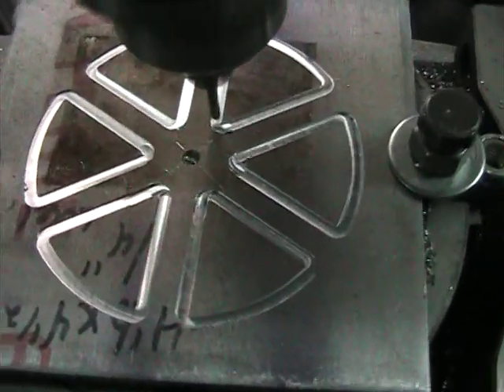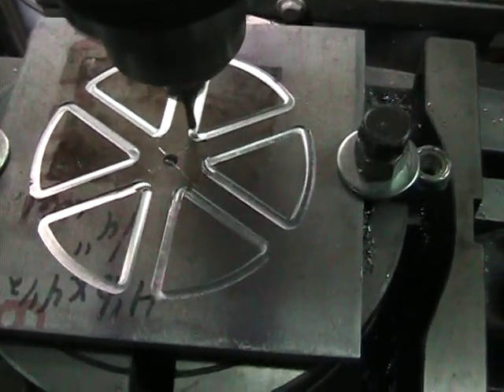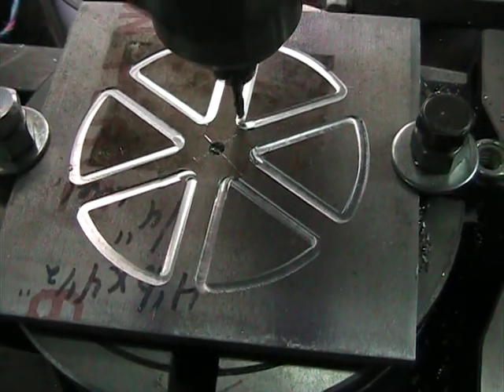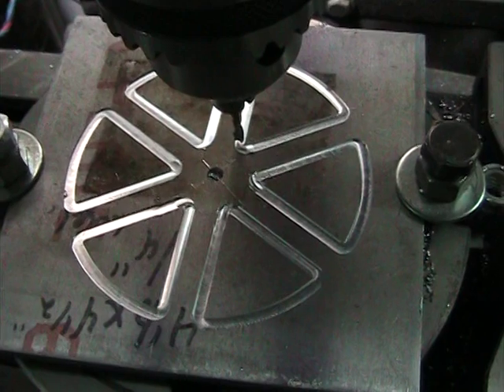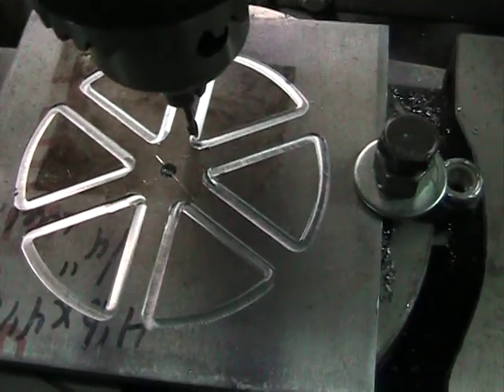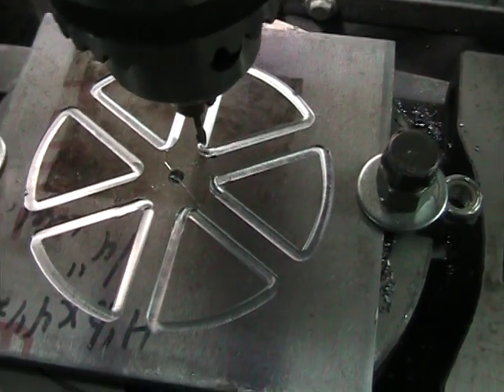There you can see what it's going to look like. The piece of aluminum is four and a half by four and a quarter, so this will fit inside a piece of four and a half inch OD steel pipe. I'll cut a ring off the end of a steel pipe and trim this down to press fit it inside there to make the flywheel.